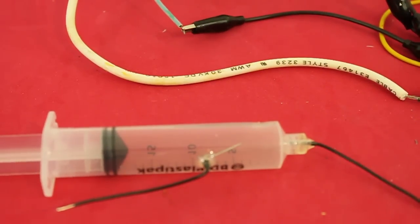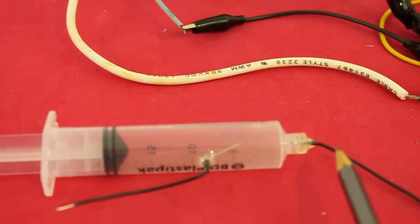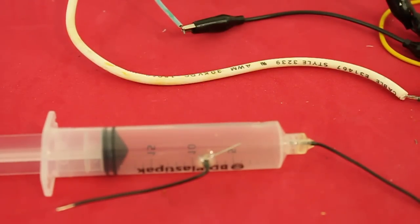And how does it work? When a high voltage is applied between the electrodes, an electrical current flows through the tube. The current dissociates the electrons from the gas molecules and this creates ions. When the electrons recombine with the ions, the gas emits light by fluorescence. The low pressure is necessary to increase the mean free path of the particles inside the tube.